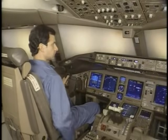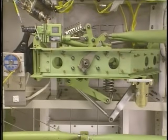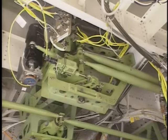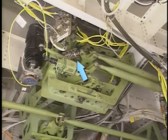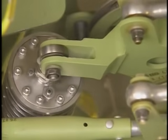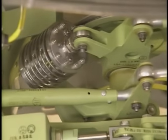The control wheels control the ailerons, flapperons, and spoilers. Turning the captain's control wheel moves the control cables to the cable drum on the left lateral control mechanism. This operates the wheel force transducer. The wheel force transducer has two functions: it supplies electrical signals to the bank angle protection function, and connects the left wheel drum to the left crank, which moves the left shaft assembly.